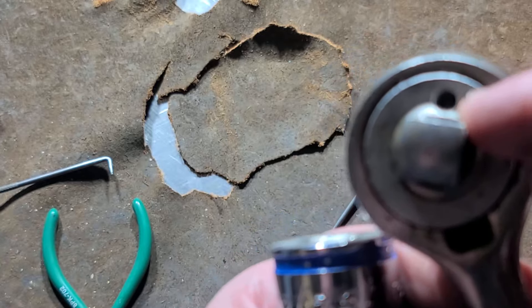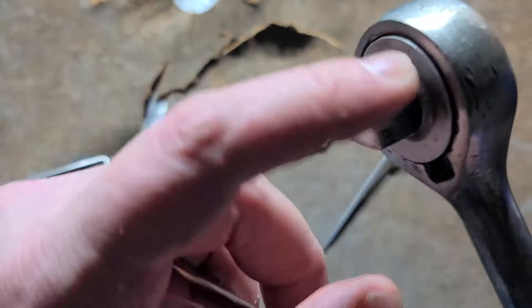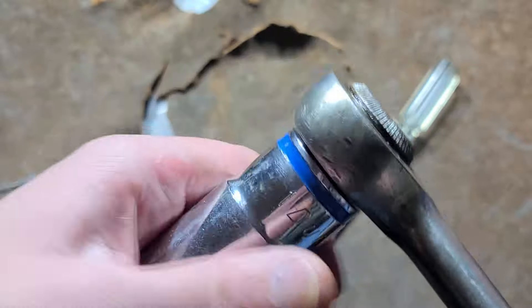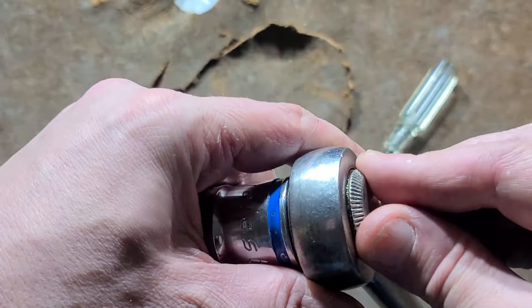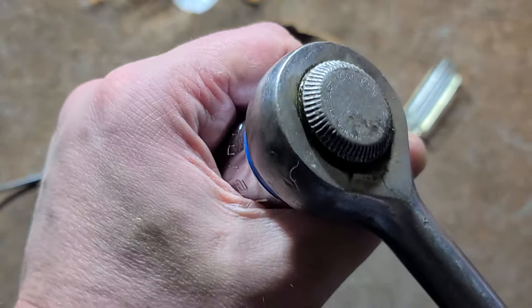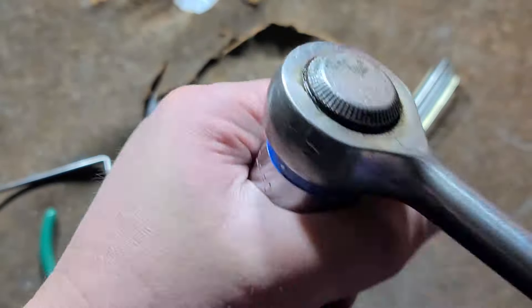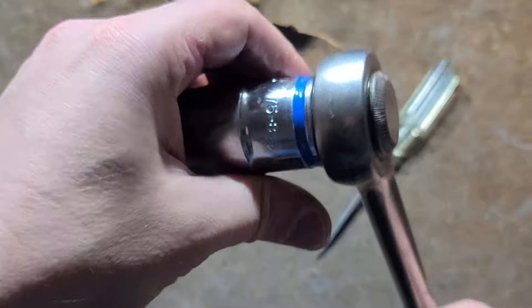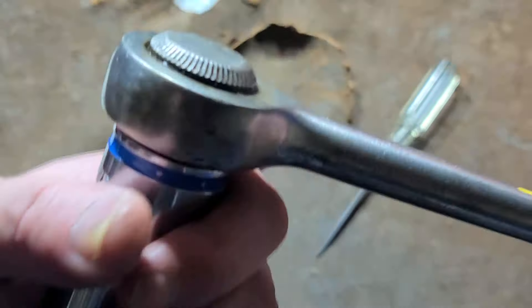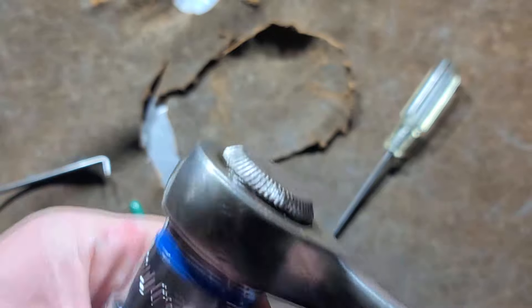So when you put a cheater bar in and the ratchet fails, it will be that pin — the pawl just pushing sideways will act like a guillotine and shear the pin off. Other than that, it did bring it back to life — just a little bit of oil. I'll still keep this one around; I kind of like it and it's nice to compare it to that other Pennins. I've reviewed a lot of ratchets that are just extremely low end, and even though they're old and American-made, I'd rather keep ratchets more noteworthy of keeping. But I think I'll probably keep this Pennins just because it's definitely old — more than half a century old — and I'll be able to use it to compare to any other Pennins I run into.